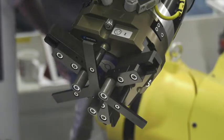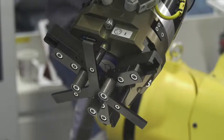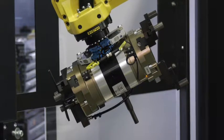A theme with Halter is automation made easy. So you're running from this machine here — a Nakamura fixed-head turning machine — and you want to do some milling tomorrow. Easy enough, we just pick it up and move it onto one of our milling machines. We've got three fingers on here at the minute for the turning machine, and we can easily change that for a two-fingered one to pick up prismatic parts, and there you go — back onto milling.